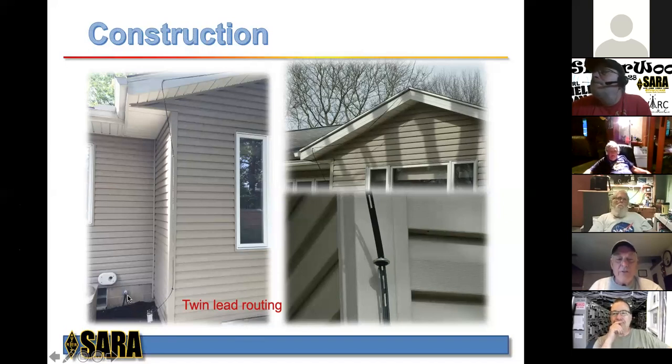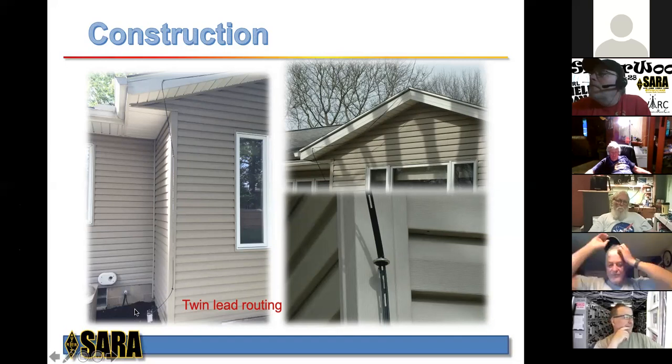So you can see this thing goes in and over, and it's a very short distance for the coax to travel. So you've got the twin lead, which obviously doesn't have a dielectric to heat up and waste your precious electromagnetic energy, and then a very short piece of high efficiency coax does a nice job. So anyway, that's how that's put together.